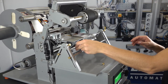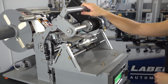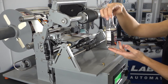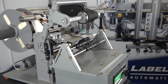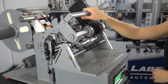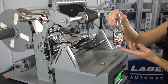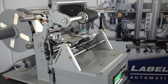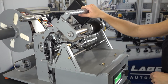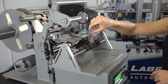The model 130 is a semi-automatic tabletop stand-alone applicator that will consistently and repeatedly put the label in the same position. The operator simply puts the product into the tray, butts it against the stop, pulls down and holds down firmly until the product completes its rotation. It'll only feed one label as programmed right now, but it is capable of two labels in the software with a few setup changes, and it's easy enough for an operator to learn in just a few minutes.